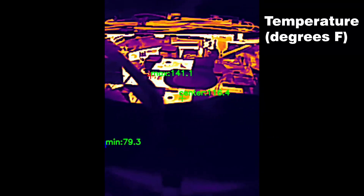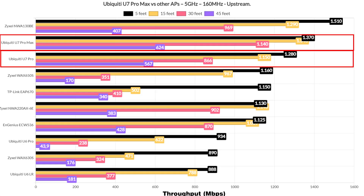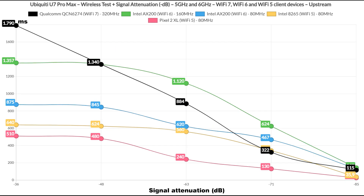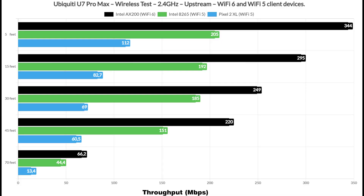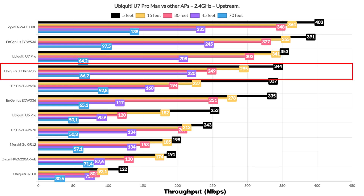Which is why I have to ask you — the one watching this video who has this device — if you saw something similar. As for the 5GHz throughput, it was better than on the U7 Pro, which was to be expected considering the improvements between the two models. Regarding range, I have included the signal attenuation and throughput I experienced. As long as you configure the channel right and keep the interference in check, the throughput can go above 100 megabits per second even at 70 feet. It does seem that a bit less thought was put into the 2.4GHz performance, because the throughput was less impressive than what I saw on the U7 Pro, though it's fine and usable for smart devices.